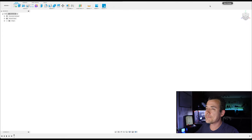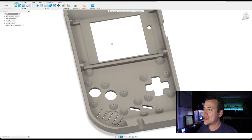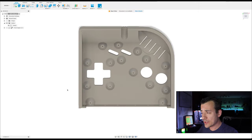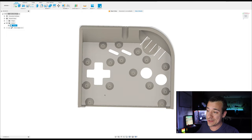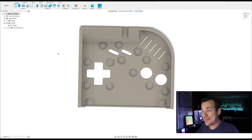Let me show you an example — this is the giant Game Boy I've been working on. These shell parts I wanted to print vertically, and there are screw posts on the inside that without a chamfer would need a bunch of support material. By adding those chamfers, I can print them without any supports at all. You can see I used that same trick at the top and on the side to cut down on the amount of support needed quite a bit. It's not something that works every time depending on what you're making, but it's a handy trick to keep in mind as you're designing.